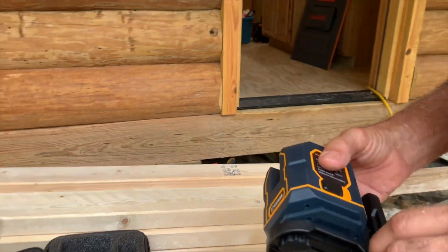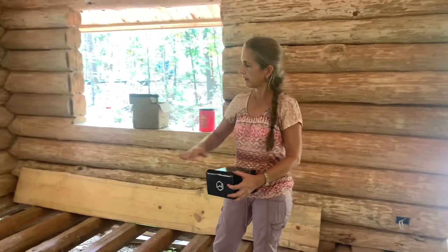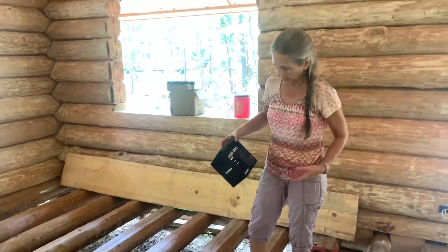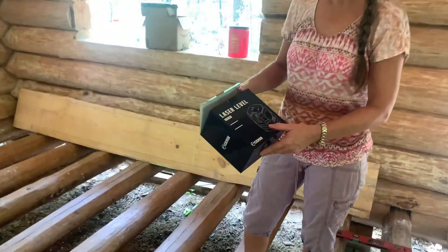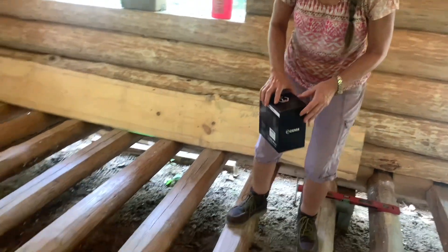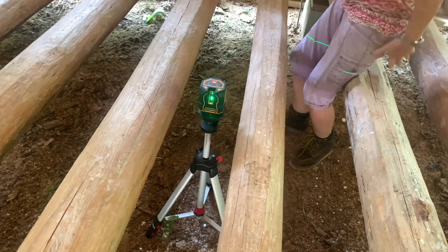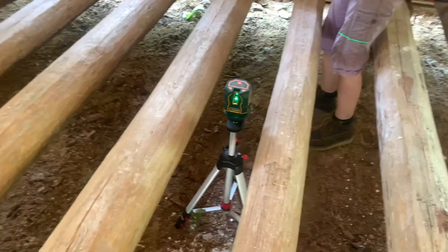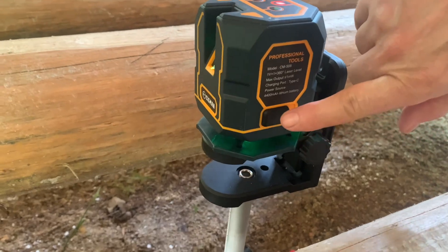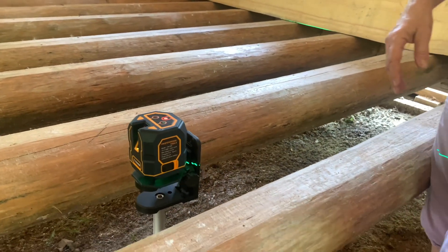Alright, so we'll get to the video now and show you how we used it to level our floor joists. We're getting ready to level the floor out again and make sure nothing's shifted. We've got it pretty close, but we're trying out this new tool — the Cigman laser level CM-508. I've got it set up on the old tripod. It comes with a holder but you need your own tripod; it fits on just about anything. I've got it in manual mode right now — there's a little switch on the side that you turn on for manual mode.